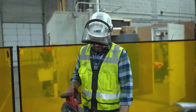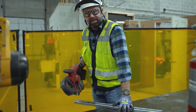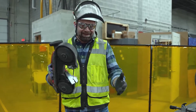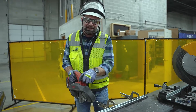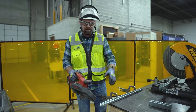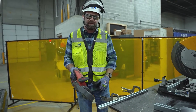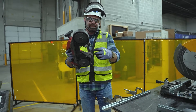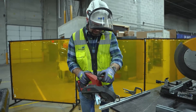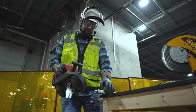Can't use this bandsaw one-handed. You slide down the guide, find your line, and make your cut. In order to do that, you've got a hand here and you've got to clamp it down. So let me go find a clamp. We're back — when you realize you've got to have two hands on the saw and you want to make a very simple cut, a few folks cheat this once in a while. That's a no-no. They do make smaller saws that don't require that, but they're a lot less powerful — smaller batteries, a lot fewer cuts. This size saw is pretty typical. Traditional blade rotates around, you're gonna clamp your piece down, turn your light on, hit your safety, use your guide.